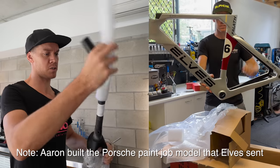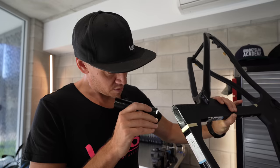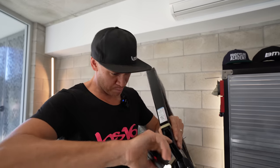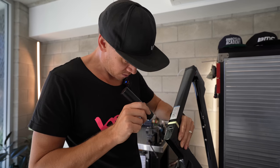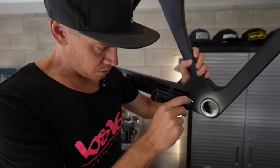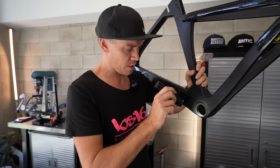Visual inspection. It looks the same as the other one, but again it's just an external visual look at it. This looks a bit different — it looks like there's a high fill. Remember the first one where the seat post wouldn't go in? This was fixed from the prototype, but I would say it's got bog, like a car filler on the top of there. And then this area here on the top is a bit rougher. The peeling in the bottom bracket shell — a lot of that is to do with the bladder that goes inside, and they've just ripped the bladder out and it's probably pulled the resin or the top surface resin with it.